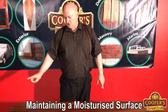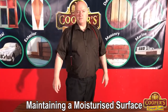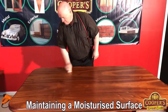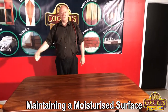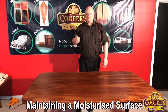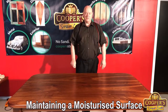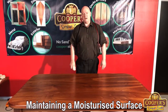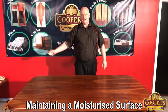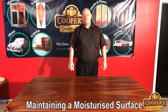I want to show you how we would maintain it. If you've had a party and for some reason there's a watermark on it, what you do is get a rag, get some water, and you just buff the mark. Nine times out of ten, mark's gone. Do not use furniture polishes on this — don't go and buy some commercial furniture polish. It's likely to have silicone in it that will really hurt the finish. It'll go into the wood and then you'll definitely get heat marks. All you do with this finish is wash it — lukewarm water out of the tap, maybe a drip or two of detergent, and just wipe it over like you're cleaning the bench.